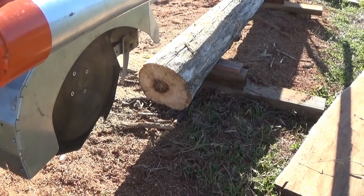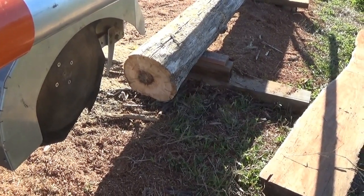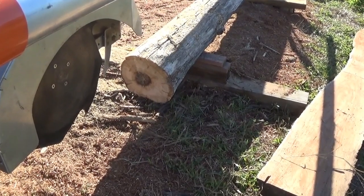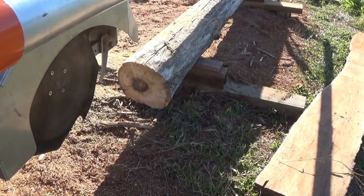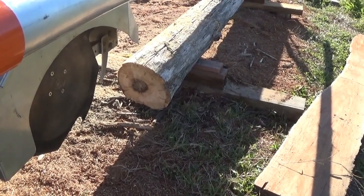The idea of putting that bit of a line down with the saw, and I shouldn't have cut that way, but because it was such a light cut, I get away with it. Cutting that way, the saw is actually climbing, and it's really a no-no. Shouldn't do it, but because it was such a light cut.